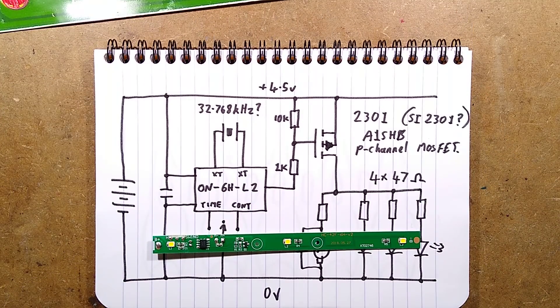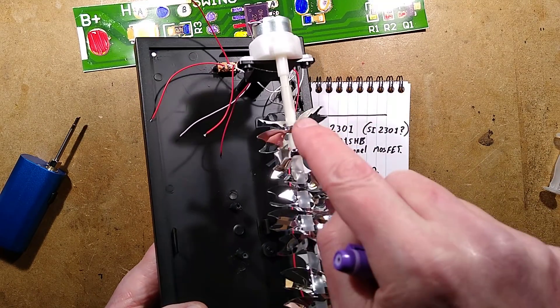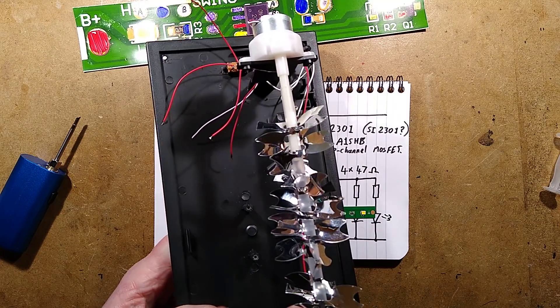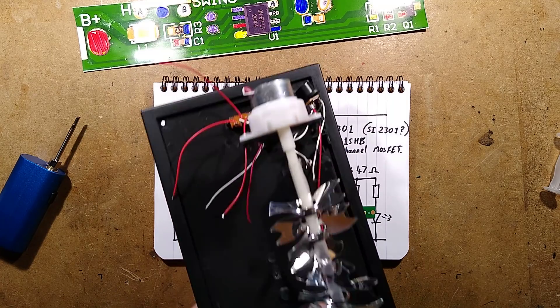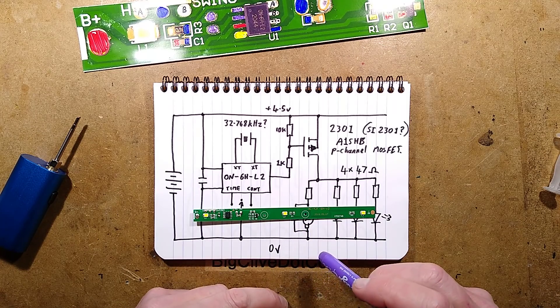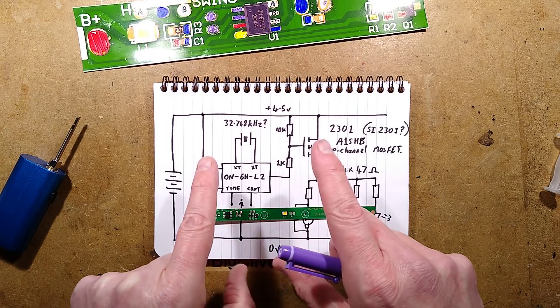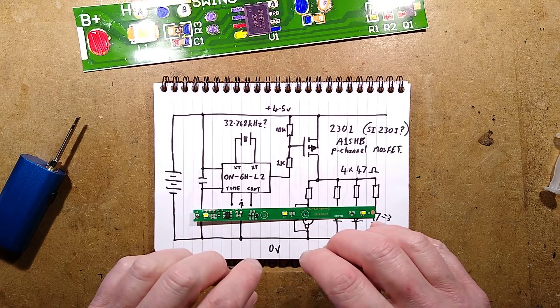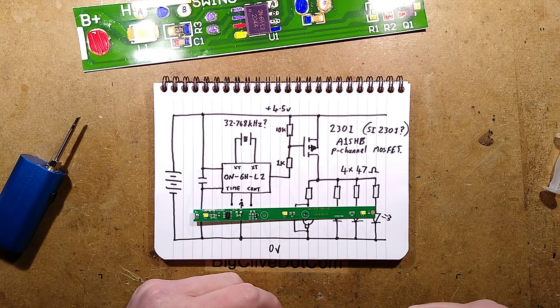So there we go. I would say the whole device is actually worth buying just purely for this assembly in the base - even just the motor, this section of mylar on the pipe, and the circuit board with the LEDs. Although for more power you could use a bit of 12 volt LED tape with a bigger resistor in series and run the whole lot off 12 volts, or replace them with higher power LEDs to create a much stronger projection effect. It's not an efficient way of doing it because most of the light is being wasted in the black interior, and it's only where it hits the reflectors that it splays out. But it does a good job of creating a subtle, convincing effect - just that flame array going up the screen. It's quite neat. I like it.